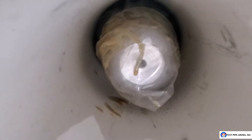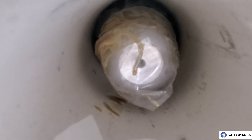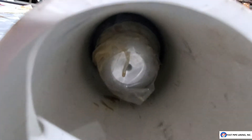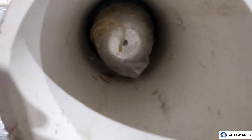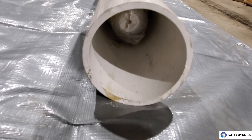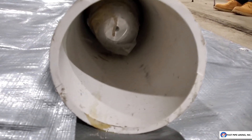Once you have reached your pressure, it takes approximately two hours for the patch to fully harden. In colder climates you may have to wait two and a half hours — it depends on how cold or wet it is inside the pipe. You can use the remaining resin to gauge how quickly it is setting off; whatever is left over in the bag and on your tarp can show you how quickly the resin is curing. It begins gelling within 30 minutes, but full hard is approximately two hours.